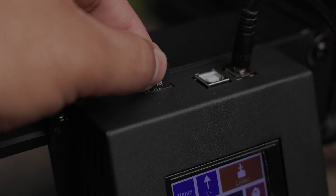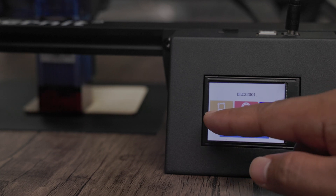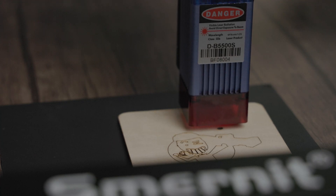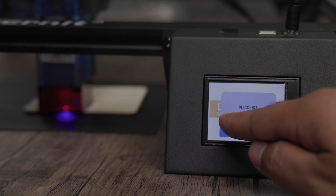Let's go back to the control panel. The control panel always loads the last thing on your memory card. You can load your SD card into the control panel and cycle through images from there. In a way, you don't need a laptop or even a smartphone — all you need is the engraver, the laser, the control panel, and an SD card with images. You can set multiple passes and it's a very set-and-forget kind of thing, great for automated batch engraving.